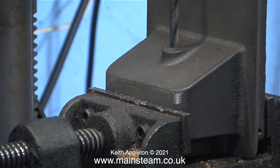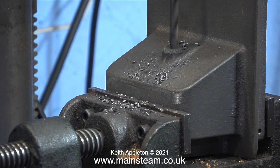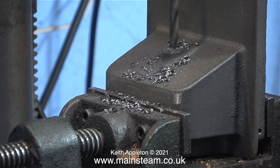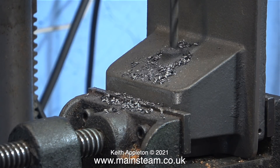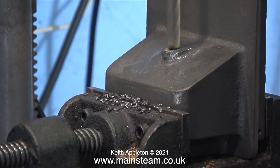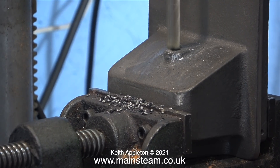This is a quarter-inch diameter hole and I'm drilling all the way through the cast iron. Don't forget: when you drill cast iron, do not run the drill too fast. This speed is okay and I'm just putting gentle pressure on it all the way. Because I'm going to fit a steam union into this boiler, I didn't want the top of this part of the casting to slope.